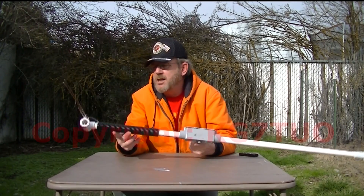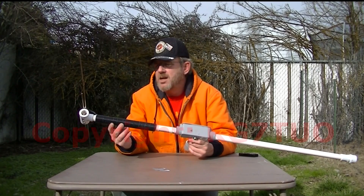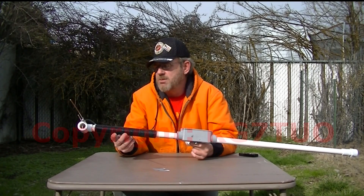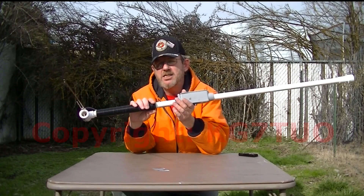With this antenna, 12 and a half feet off the ground, at one watt, I can reach the repeater at 29 miles from here. And that's not road miles — that's GPS coordinates to GPS coordinates, KG7 to UF.